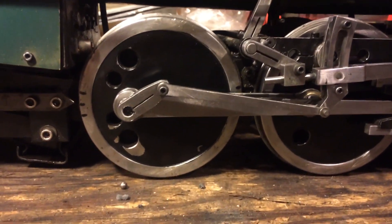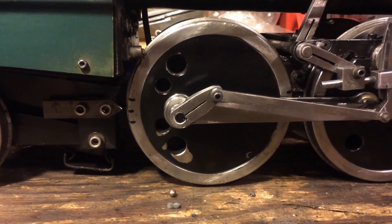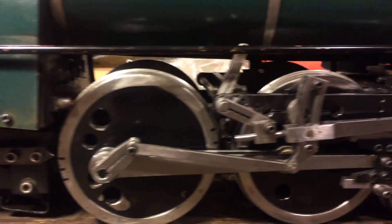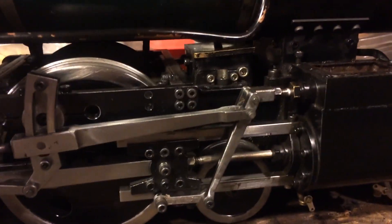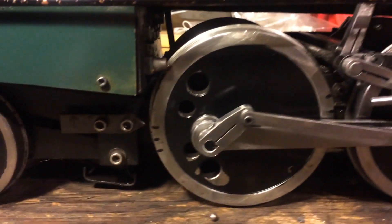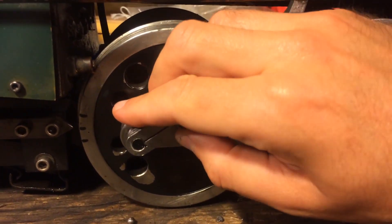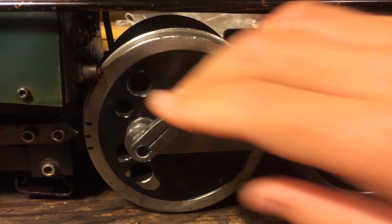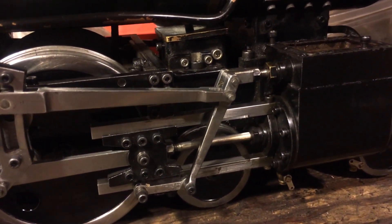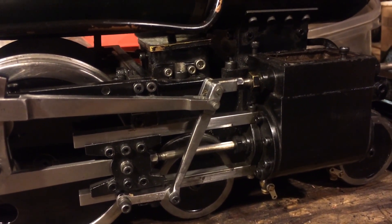You can see that even with just a little bit of inaccuracy — if we were to have a dead center off by even a couple of degrees — you'll see movement in the valve stem. And similarly, if we go back to our actual dead center and this crank is rotated just a little bit off, there's suddenly a lot of movement in the valve stem. Even just those small adjustments can really throw off your valve settings.